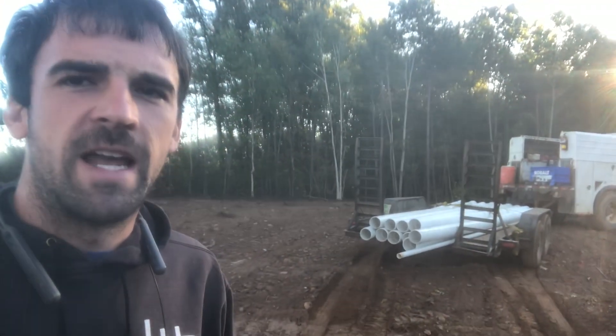The lake project is starting to wind down. We've got the lake built and need to do a little final grading. Nathan and I are about to work on the siphon system. You can see there's some pipe over here behind me — Nathan went and got it this morning. The siphon system basically takes water out of the lake once it reaches a certain level, keeping it from overflowing. If you have a heavy rain, the last thing you want is water going over the dam and washing it out.